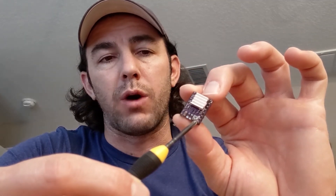Next tip, specifically regarding the stepper driver: this DRV8825 driver — I highly advise that before you ever put a single driver onto the board, you adjust the total current to zero. To do that, simply adjust this tiny little potentiometer right here — turn that pot clockwise until it bottoms out.